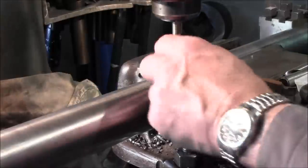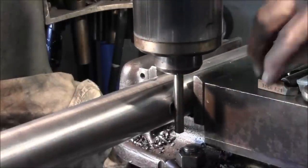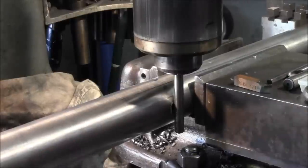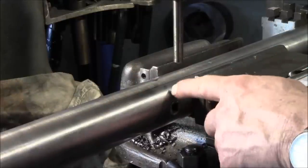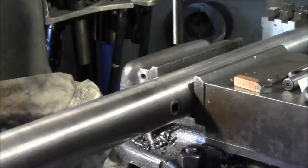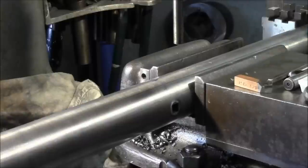I got a 3/8 rod in here, in the 3/8 collet. And we're working a 3/8 square hole here, so all I did was bring this in close, and I'm just getting side to side alignment strong enough or close enough so that we can put in two 1/4 inch set screws right here and here. All right, so I'm happy with that centering location there.